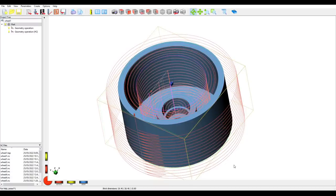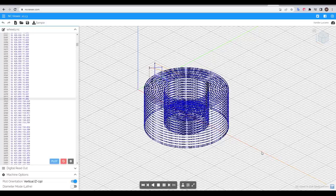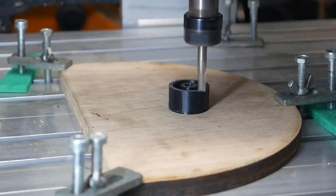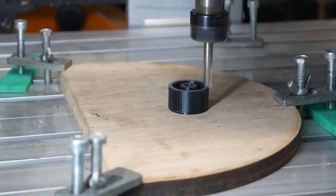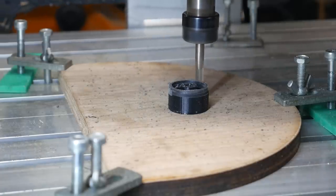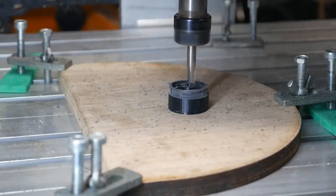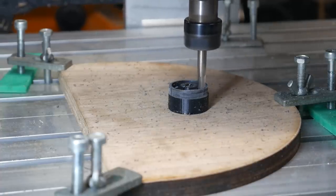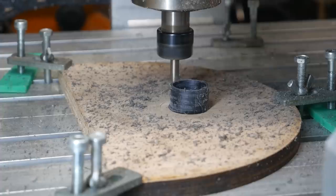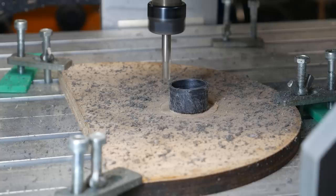Visualising the gcode, we started off with a meandering toolpath — a mix of conventional as well as climb cutting. Spindle RPM was 15,000 and feed rate was 500mm per minute, which I thought was a little slow, so I used the machine controls to manually double the feed rate to 1000mm per minute. The toolpath at this stage was pretty inefficient, cutting an outer section and then lifting up to return to the interior. My thinking was this would give the plastic some time to cool. My favourite part was when the temporary boss was milled away in the centre, but what I didn't enjoy was seeing the screw come loose and the model remove itself on the final pass, ruining the exterior of the wheel.